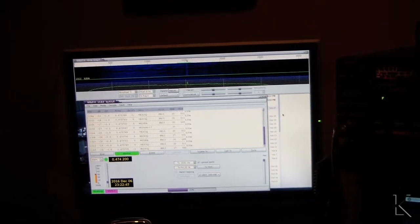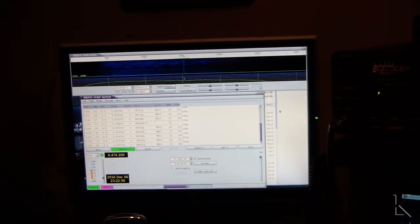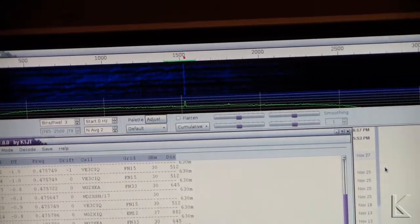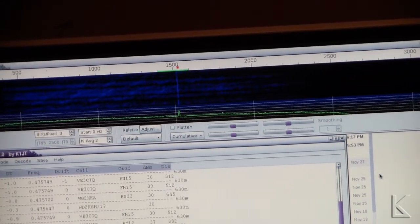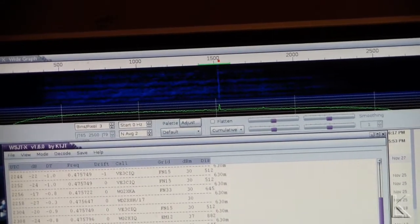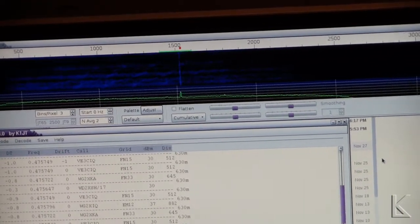And there we go — none of that interference at all. Completely eliminated. So if you have internet coming in through fiber, be aware that they don't ground the terminal. Check the ground with a meter to your AC ground to make sure there's no high transient voltage there, and ground it. As you can see, I see one trace in there that's a WSPR signal. I think I can still see just a slight hint of the interference, but it is so low I can't hear it. We've really improved the band in the low frequency ranges — the bottom end of medium wave. Find your noise sources, make sure that they're grounded, and you'll quiet up your HF. 73, and thanks for watching.